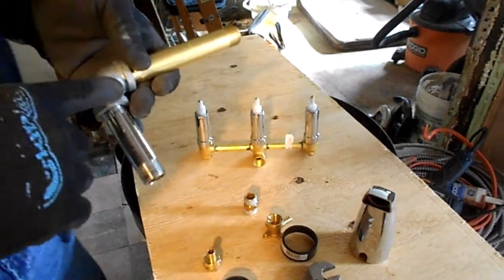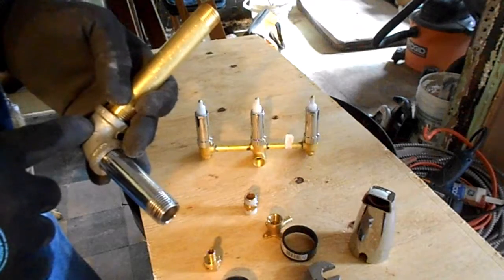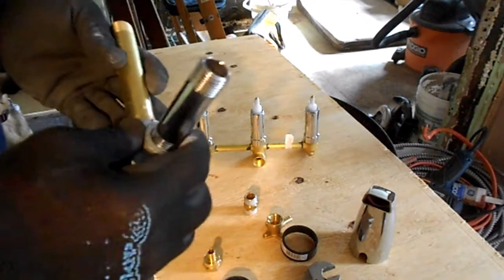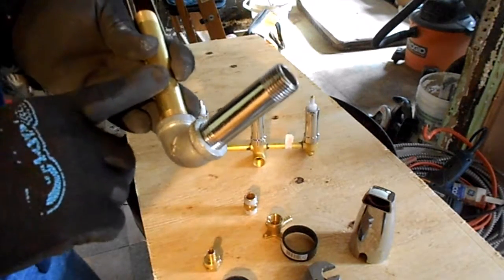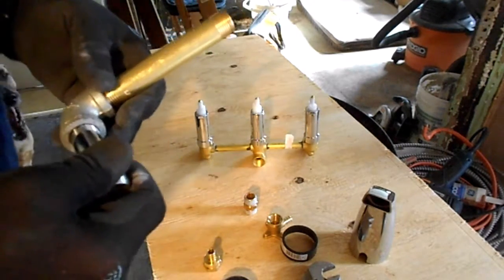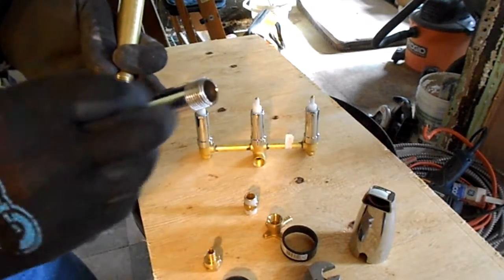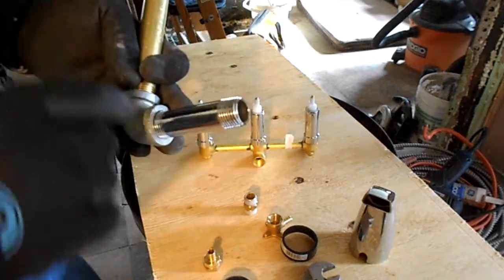Now, we talked about the other, if you remember in the previous video where I was talking about the tub was all rusty. The reason was, whoever had put that spout or the adapter for the tub spout in, they used cast iron or black iron pipe. And so it tends to rust, and then when you turn it on, you get a little blast of rust water, and then it runs clear.